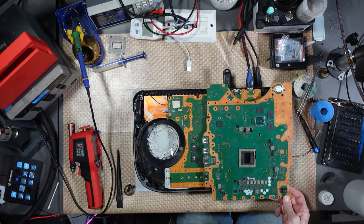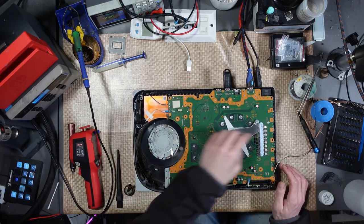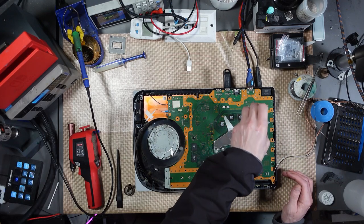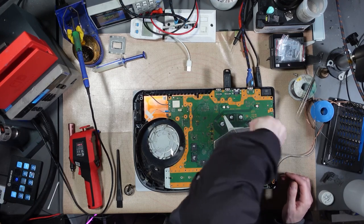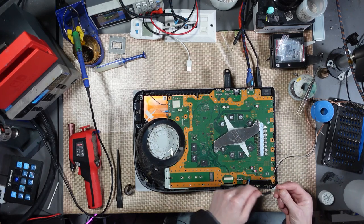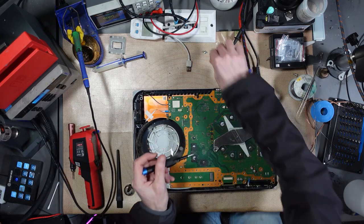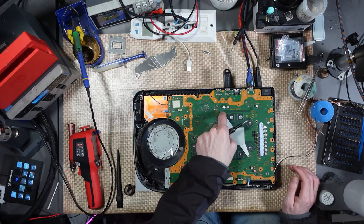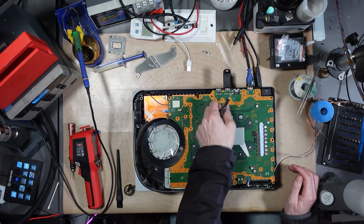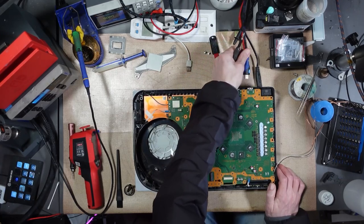I'm going to take my mic off because the batteries have failed on my microphone. That PS5 board is on the BGA machine just off to the side. One thing I do have now are all the stencils you're ever going to need for the PS5 — I've already got the RAM stencil, a 6-way RAM stencil, or GDDR6 stencil. But I've also now got specific stencils for the APU, the SSD controller, and the Southbridge. All magnetic stencils, and they look absolutely awesome.